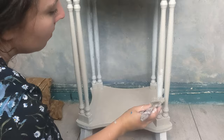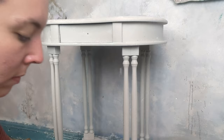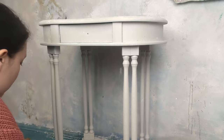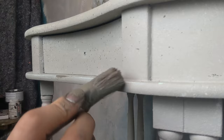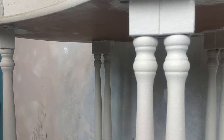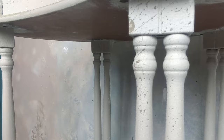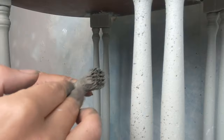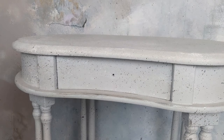I've poured Phthalo Olive into a cup and I'm adding a little bit of Wharf, some water, and also some Anchor, which is a black paint from Dixie Belle, just to give it a cooler edge. I've got a stencil brush and I am just speckling this onto the piece, then dry brushing a little bit around the edges where some blue was peeking through. Speckling is a little bit of a messy business, so make sure surroundings are protected. If the paint is too gloopy, add a little bit of water. By speckling we are creating a foxing look, just to add more age to the piece.